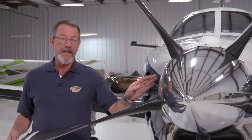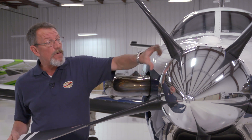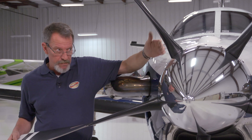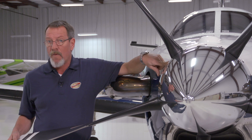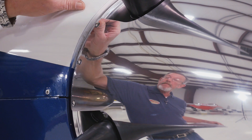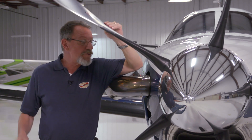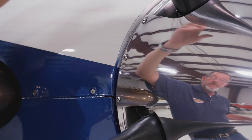Next, you're going to want to inspect the spinner. When you inspect the spinner, look for loose or missing hardware on the attachment points, and look for any cracks, especially in the areas around the attachment points, but anywhere else on the spinner as well. You'll get concentrations of stress around the attachment points, so pay special attention to that area. Look at the spinner closely and make certain there are no cracks or gouges, and all the hardware is installed and secure.